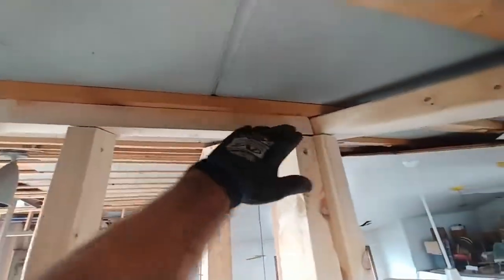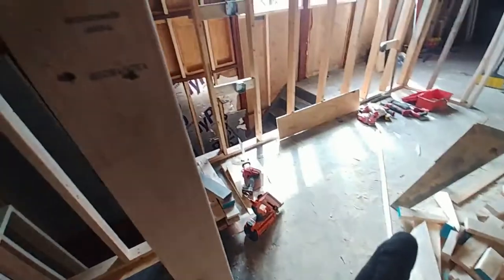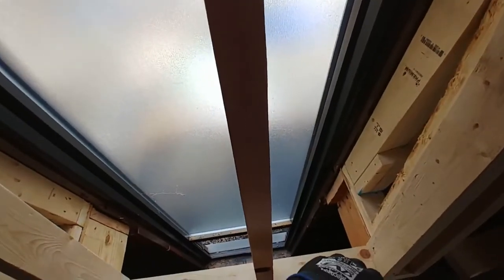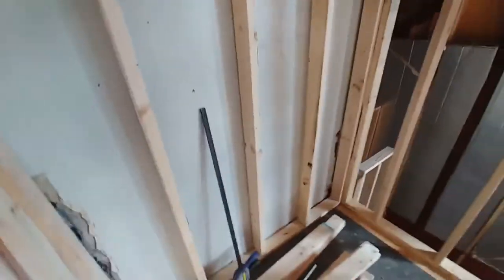It's the right angle, but this furring strip is rolling up, so it's pulling my joinery apart there. But overall, the other subject of this is that I'm going to continue to use a variety of expanding foams. We've got the black for big gaps, the red OG, and the window and door. So the window and door, I'm going to come in here. This is the rough opening, see this, there's just air gap all the way around this window. I mean, that's massive. I don't know if you can see it if I let the camera expose, but all that's got to be pumped full of foam. I'll use the window and door foam in there so it doesn't distort the jambs, and then we'll use the big gap foam in areas like this corner.